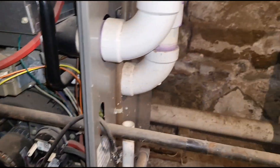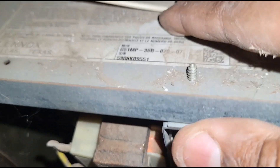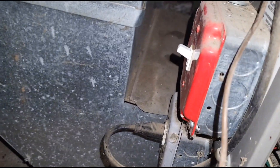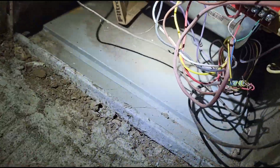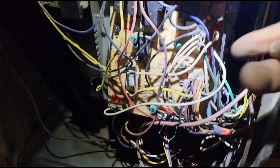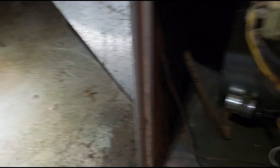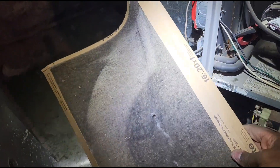Alright, I'm downstairs — this looks like a heat-only furnace, looks like this is a Lennox 5906, and I've got my thermostat calling. Door switch is in and lights are off — that is weird. I'm looking for fuses; is there a little fuse on this thing? No, there isn't.